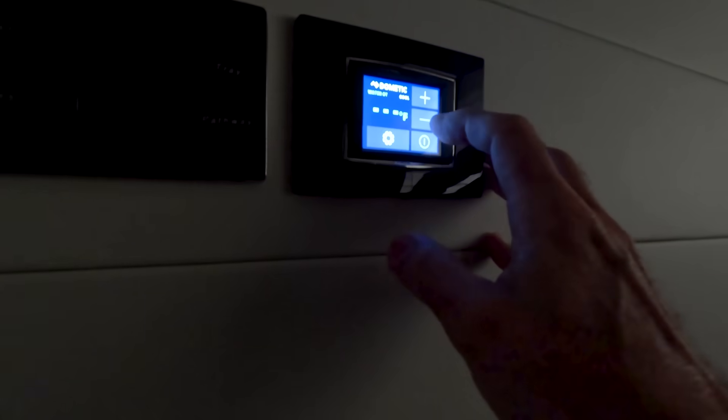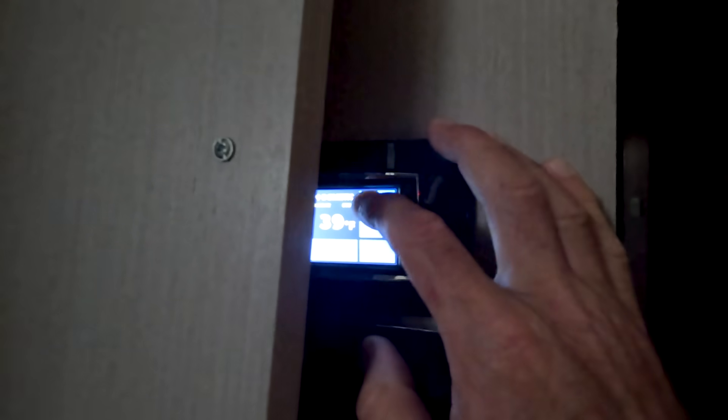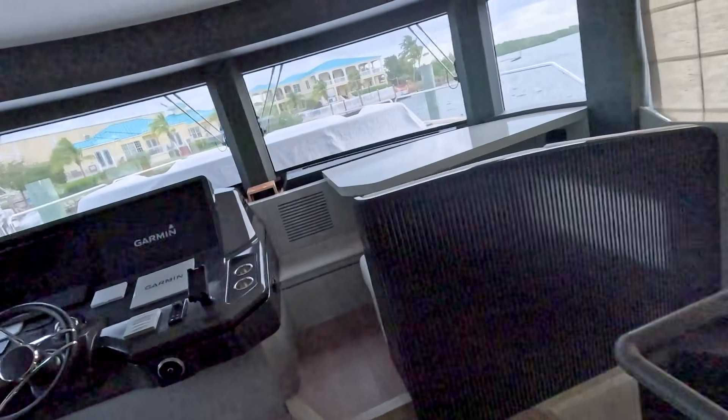All the sensors are working. Here's the fore-state room — yep, everything's good there. We'll put everything down here to 70. I'm checking the water-in temp on all these displays because what happened was all of them were reading like 170 degrees, so the units wouldn't cool because it was out of parameters. 12 temperature probes in total — a little crazy but that's what I did. All temperatures are good, so we'll put this to 70. Now I've got to start putting all this stuff back together.